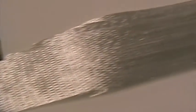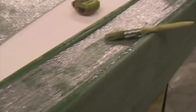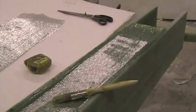and I've marked out graduations there for layer 1 through to 38. And there's the pre-cut UD glass, 110 millimeters wide, and using extra slow resin, I'm going to paint it in there and start laying in the layers one by one and squeegeeing out the excess resin. Here I'm busy with the 10th layer, 28 to go.